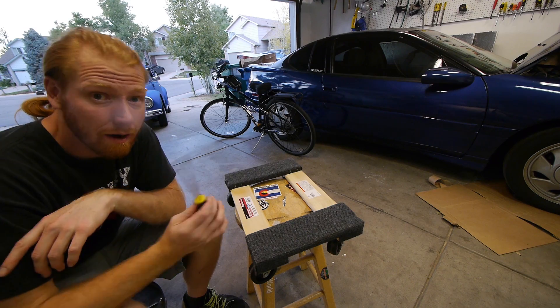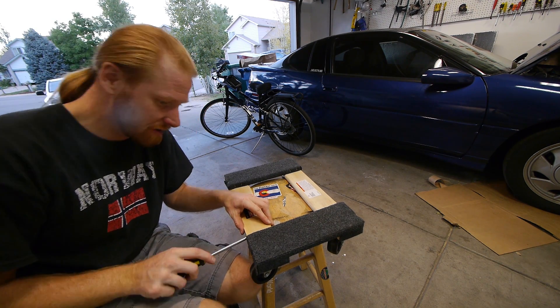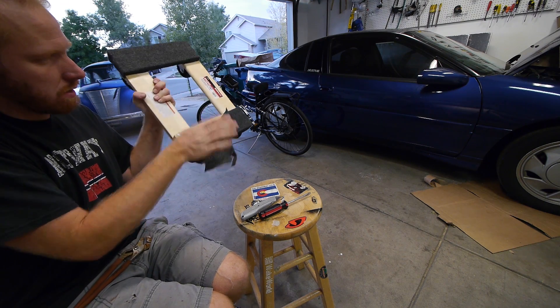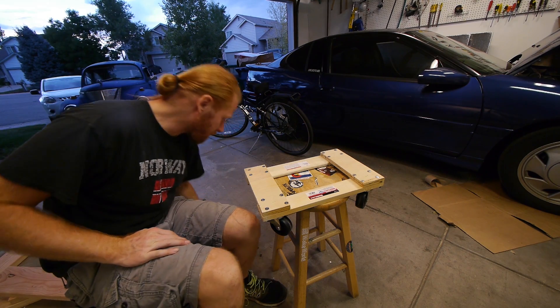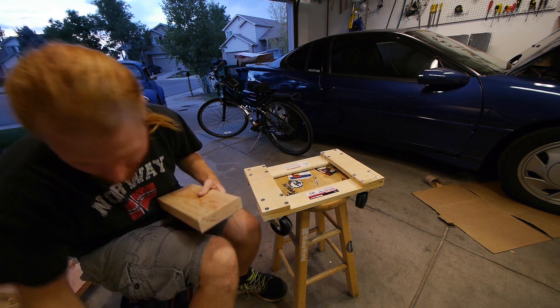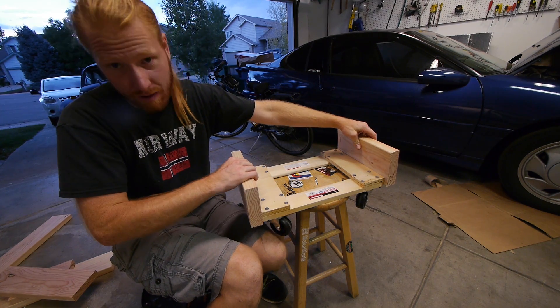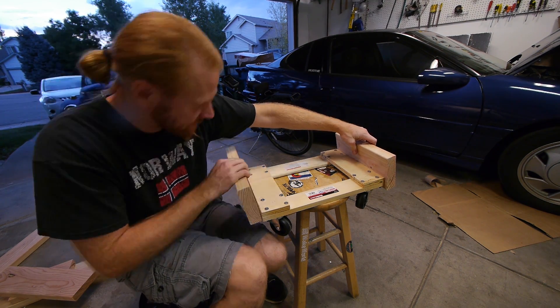Back in the garage. We don't need the carpet, so let's go ahead and strip that off — just a bunch of staples holding it down. Once all the carpet's cleared off, we're gonna take both of our 12-inch pieces and those are gonna get attached onto the ends. So I'm gonna clamp one in place, drill some pilot holes, and start screwing it on there.